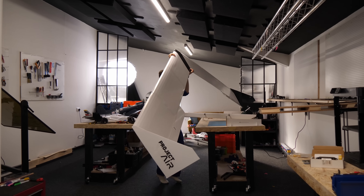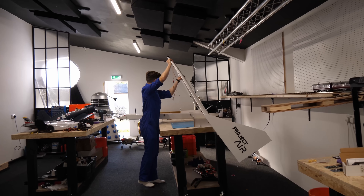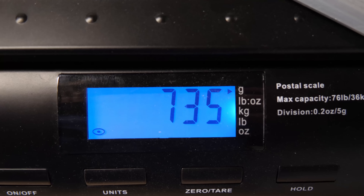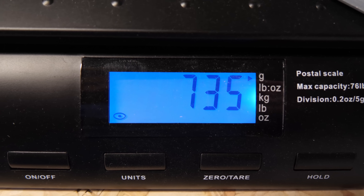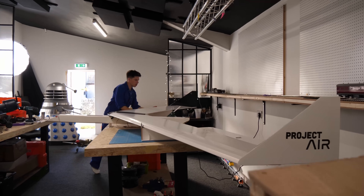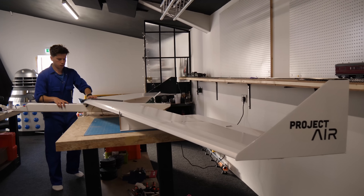We had discovered a few key issues with the flying wing that we would need to fix before the next test flight. The wings were bouncing around all over the place during that test flight, so I'm going to do what I should have done from the start and use some big aluminium L brackets, just sliding them up the wings to hopefully stiffen up the whole cantilever design. The wings just have a foam board spar in them, and that's not strong enough — it's too flexible. Adding aluminium would increase the all-up weight of the aircraft by 700 grams, and that's no small amount when every gram counts.